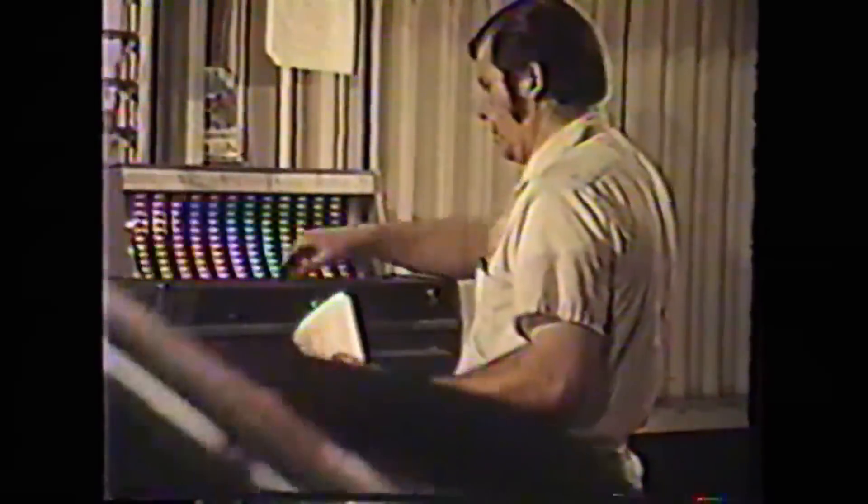When the body arrives at the assembly plant, it immediately undergoes a retest of all electrical items. Should a discrepancy turn up, it is repaired right now, not passed along to some future station on the assembly line. This is known as the build-in station concept, and it's the law throughout the assembly process. At the same time, the computer passes information regarding problems back to the body plant so that they can take immediate action to correct the cause.